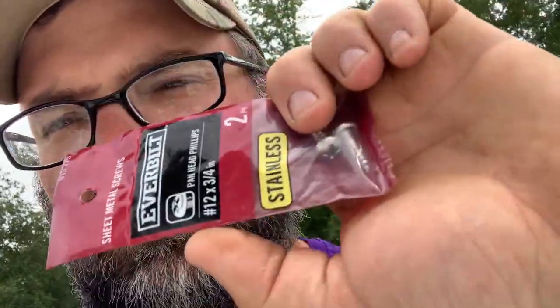As far as tools go, I got some marine sealant — 5200 or 4200. I went with 5200 since I don't plan on taking these off. I got some stainless steel number 12 screws. What I advise: if you get a different brand of rod holder, take it with you to Home Depot or your local hardware store to get the right hardware. I went up into the bilge and took some photos to make sure I wasn't going to hit anything critical — and there was nothing in the way.